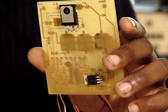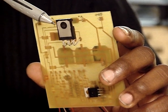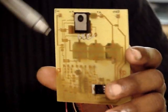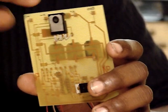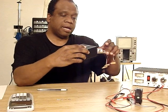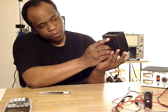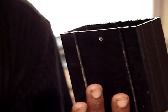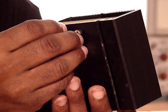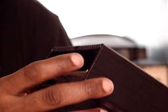It's rated at 830 watts, outputs up to 430 amps pulse and up to 160 amps continuous. It's not your everyday MOSFET — a lot of the ones you're used to seeing run somewhere in the two dollar range; this one costs a little over eight dollars. The way it all fits into the chassis — this extruded aluminum heat sink chassis — it slides in like that. You can see where this hole is pre-drilled, and then the mounting bolt goes right through the MOSFET, then a washer, lock washer, and nut to secure it in place.